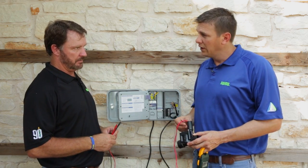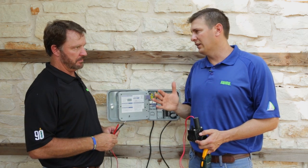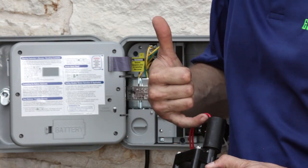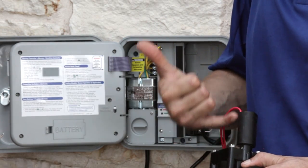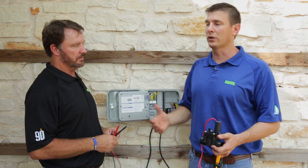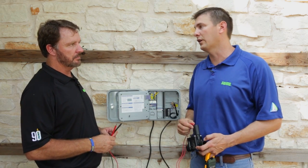And what if it was less than 20? Less than 20 — it's got to be less than 10. If it's less than 10 ohms, what's happening is that the signal's not making its way through the entire coil — it's taking a shortcut. And that's what is meant when we say that a system has a short, and that pulls too many amps and will trip breakers and all kinds of stuff.